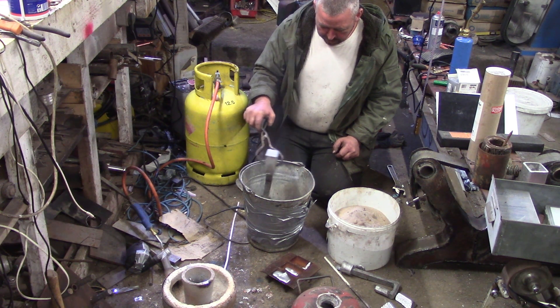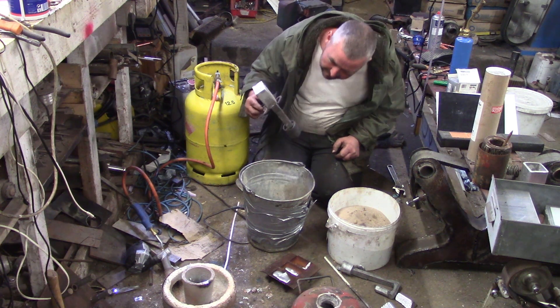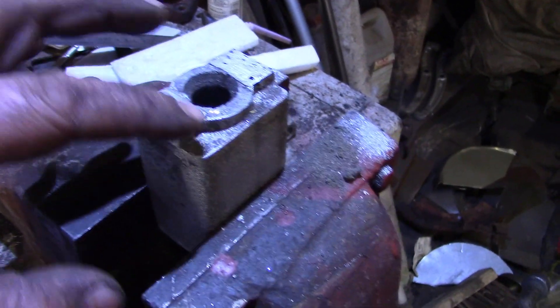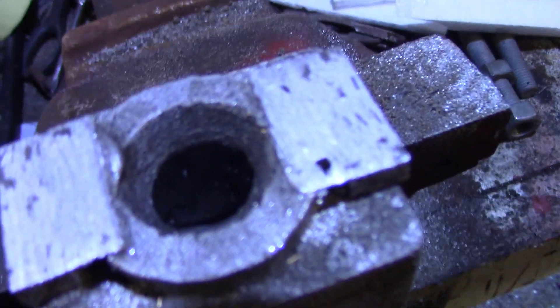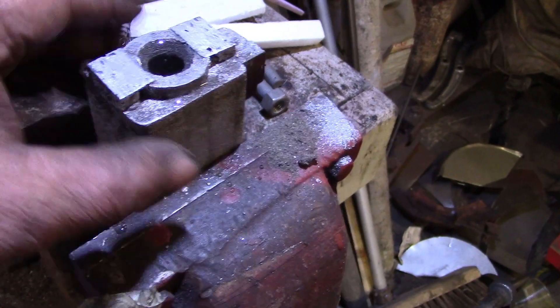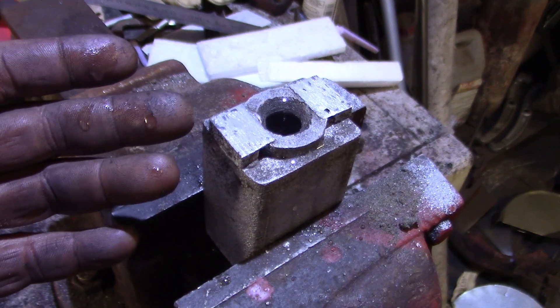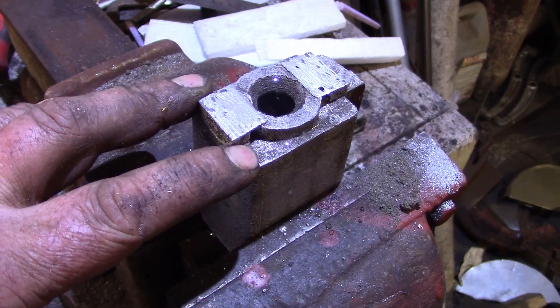There's a lot of sand that came out of there. Whether we've got a good and true reproduction on the inside is a different matter entirely. We've bloody done it, look! I've had a peep inside there - the water, can you see the little air bubbles there? It appears to be fairly decent inside. I'm half tempted to cut it just to see what's happened in the shoulders, because that's the real test. The whole point of this was to mess around with the coating and vibrating the sand. Coating was good, although I gave up on that purely because of the time constraints - it wasn't conducive to a high rate of experimentation, if I had to wait a while before each one went off.